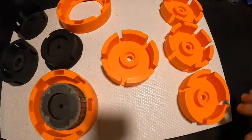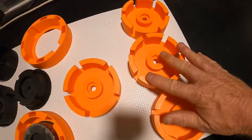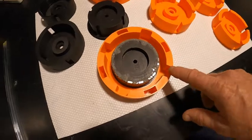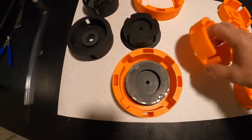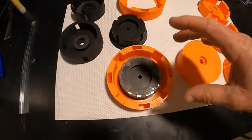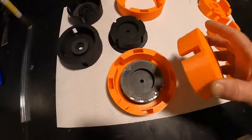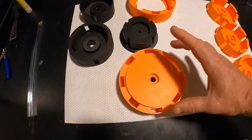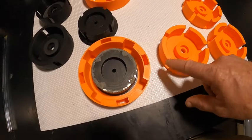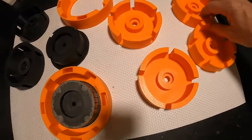As you can see, there's a four-pole, five-pole, six-pole, and a seven-pole rotor. Here we have a four-pole magnetic array and a four-pole stator. The bearings are designed to sit in the rotor. The end motor would have the bearings in the stator and the shaft going through the rotor, so we can drive loads off it. They're designed to fit in there.